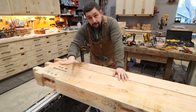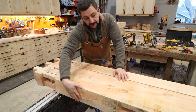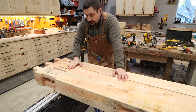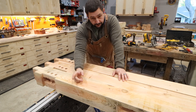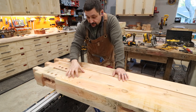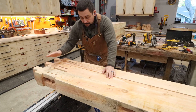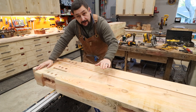Everything on these three posts has been identical up to this point — we cut the tenon, we cut the mortises here, and we cut three of the diagonal brace support mortises down the middle. At this point though, two of these are going to need a diagonal brace support to come off of opposing corners in the building, and the other one needs to match an existing post that I already practiced on. So we have flipped them accordingly — these two are rotated 90 degrees to the right, and this one is rotated 90 degrees to the left. This will allow me to do all three mortises for the top beam in the correct location. So we've got them all lined up and now we need to get them laid out and get the material removed.